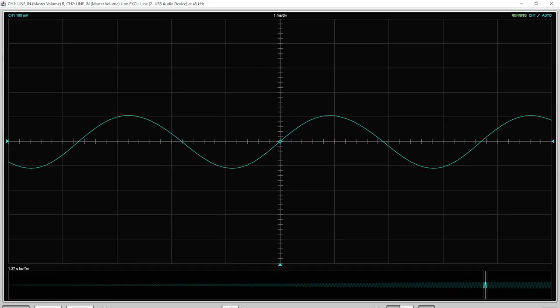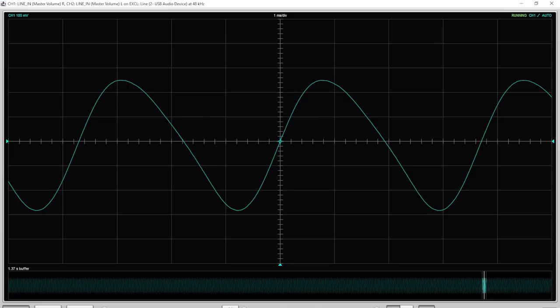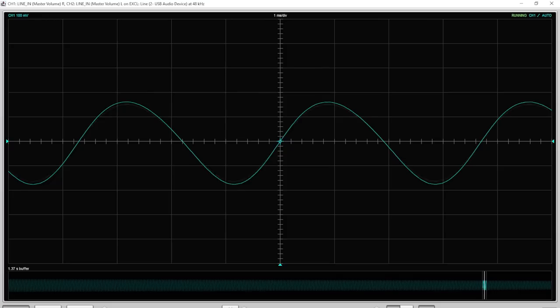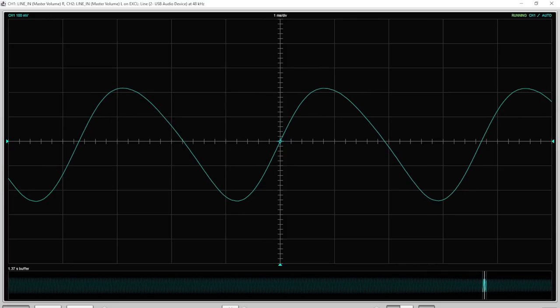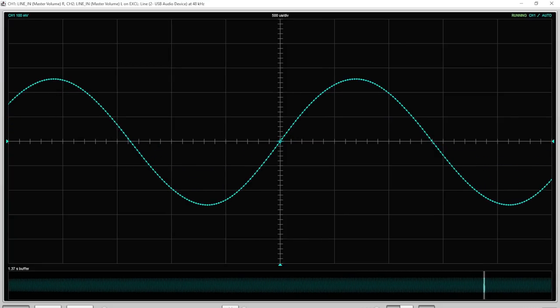Next up is 270Hz, and this is interesting because the waveform looks relatively clean, but it's leant back, kind of slanted backwards, and I've noticed that's because at higher frequencies, this driver likes to oscillate on an outwards center point. It kind of pushes itself outwards and stays there and oscillates around a new center point. I think that's just something to do with the driver. And the second harmonic doesn't come up straight away, only as we get towards limits, and the others aren't too prominent either.